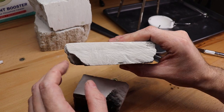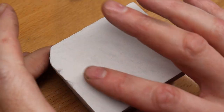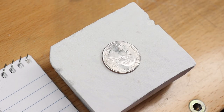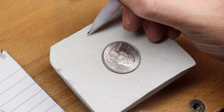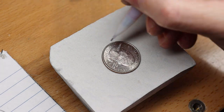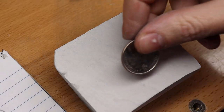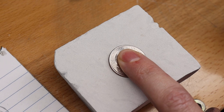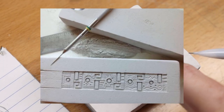How do you carve it? This is the flat surface of my tufa stone and I want to make this same design on here. You can freehand it, or you can use coins like I did. I'm going to use a quarter. Make sure you have enough room on the top for a spout to come in when you pour your metal. I'm going to put the coin down in the center so it has as much space around it as possible and trace the circle. People make insanely detailed pieces using this technique, like full bracelets.